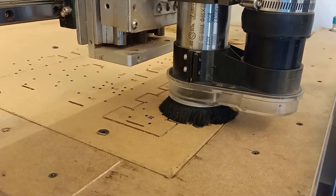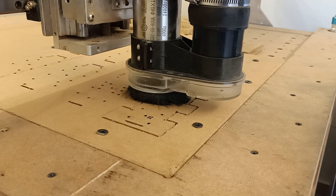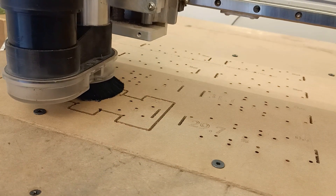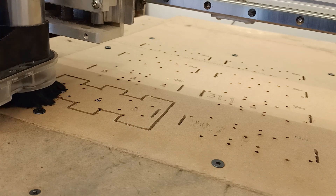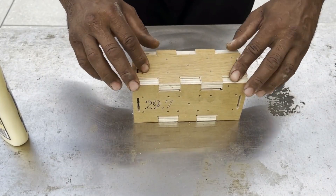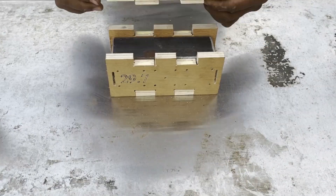The first thing I did was to make a jig for marking the locations of the tapped holes in the steel tubes. Although the four pieces could be cut by hand, I used my old CNC machine to cut out the parts. It's very important that the hole locations are accurate and that the holes are drilled perpendicular to the surface. I'm hoping this jig will help align all the holes in the eight steel tubes that make up the frame of this new CNC machine.